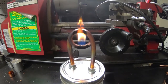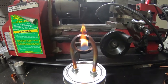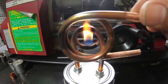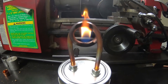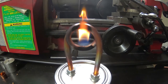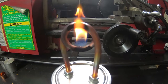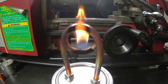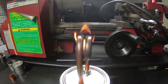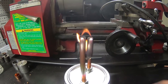I went ahead and made a few improvements and it's burning a little better — more blue flame, more consistent, no sputtering, and still really hot. What I did was change the inside diameter of the coil to about one inch, down from about an inch and a half. I also expanded the fuel hole to 7/64-inch — I might experiment with making it even bigger but the next bit size I have is too large, so I'll grab one from the hardware store. It's been burning for a while and it's a lot cleaner.